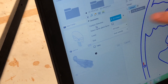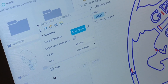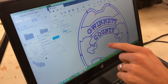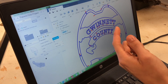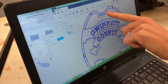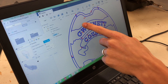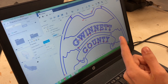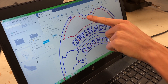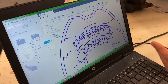Right here it'll be blank — right now I have 42 chains selected, but when you do it, it'll be blank. At that point, what you'll do is select your inner profiles first. I select all my inner profiles and it gives you these arrows. Those arrows represent whether you want the cutter to cut to the left side, the inside of the edge, or the outside of the edge. For inner profiles, I do inside; for outside profiles, I do outside. If you click the arrow, it moves to the outside of the line. If you click it again, the arrow moves to the inside.